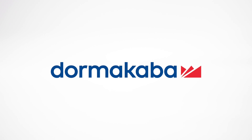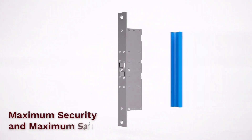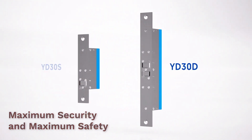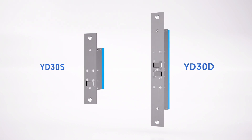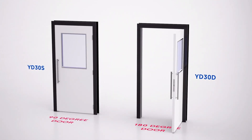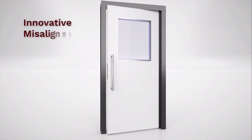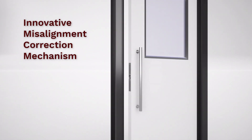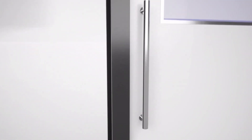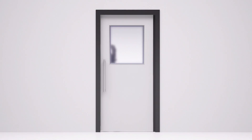This is a video animation I'm going to show. I'll be talking over it, just so you guys can get an idea of how this revolutionary game-changing lock works. So this is a blowout of the lock — this is a double here. You'll be able to see as it pulls in after the demonstration on the 90-degree door and the 180-degree door that the premise is going to be secure and the door is going to open every time. This is the only lock in the industry that has misalignment correction — up to five-sixteenths of an inch, it'll pull it in. You can see here are the pins as they pull the door back into alignment and then lock the door.